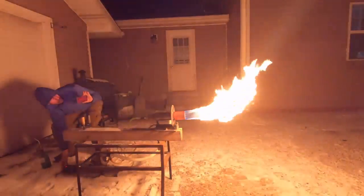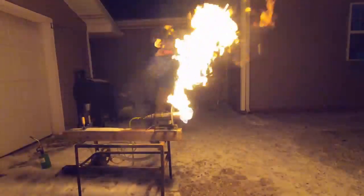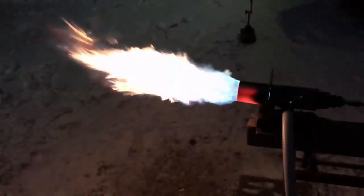As you can see, this thing is just unstoppable. We're getting a real good mix. The complexity that I put into the nozzle was worth it. If I would have just drilled two holes in a piece of metal and swirled the air around in there, it might not have worked as well at lower combustion rates. I knew for a fact that this would work, and that this would allow us to not have the blower affect this very low gas pressure.